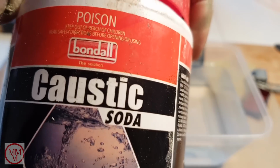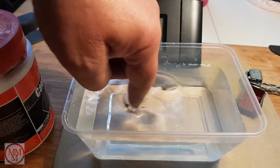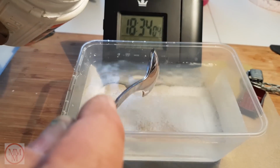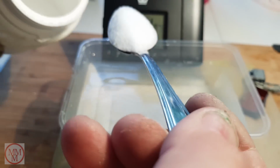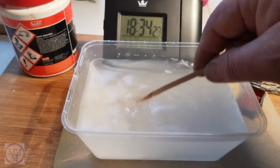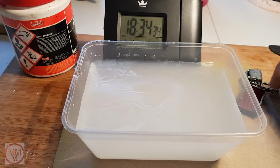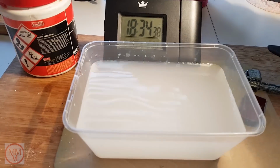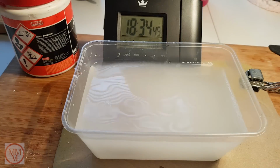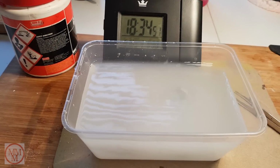Many of my subscribers have recommended that I use caustic soda to remove the paint rather than paint stripper. So I'm going to test out this theory and give it a go. Here I am putting 2 heaped tablespoonfuls of caustic soda in about 500 ml of water. I've placed a digital clock there so we can monitor the time that the object's actually in the solution. I'm using a coffee stirring stick to mix the solution thoroughly. Now I am placing the objects into the caustic soda solution. Check the time there, 18:34. Let's see how long it takes.